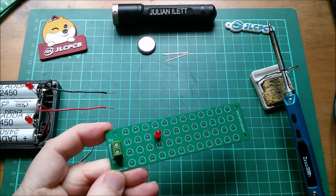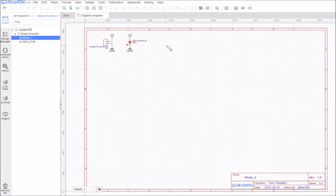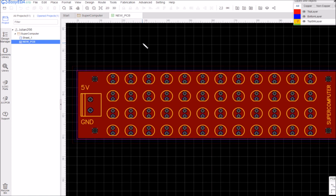Now I'm going to take a look at the schematic for this. The schematic is actually very simple — I've got a connector, two through-hole, two-pole, 5.0mm pitch, and I've got an LED. I just used a through-hole 5mm red regular LED, but of course I know the project requires a flashing LED. Two net names — ground and 5 volts. I haven't actually wired them together but I've implied they're wired together by using identical net names.